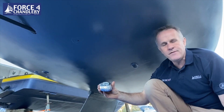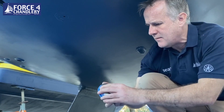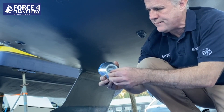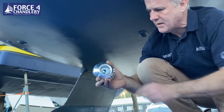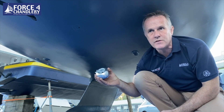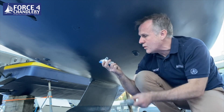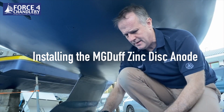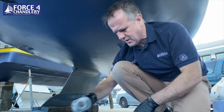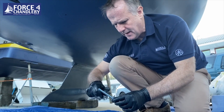This is a ZD56 kit. It comes with a backing pad — the backing pad stops the corrosion of the anode from affecting the hull. It also comes with a star washer and a fixing nut. This is great for protecting props and shafts up to about 250mm in diameter of the propeller, which is what we took off this boat — so we're replacing like for like. We've already got a hole drilled in the hull here and we're putting in a new stud because the old one is pretty corroded and we can't get the nut off.